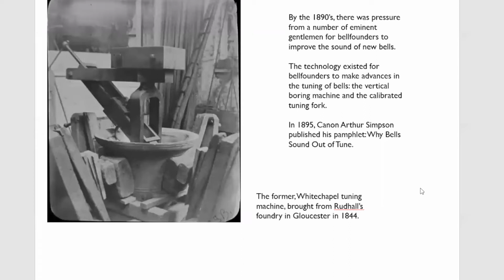They'd almost got their octave hum, and in their large bells, the fundamentals were only tending to be a bit flat. So they didn't have to make a radical difference in their shape in order to produce harmonically tuned bells. In 1896, with the new tuning machines installed, they sent out Newerby, where they'd augmented a 4 to 10. And of the 6 new bells, only 2 of them you could say are true harmonic. The other 4 aren't that far off. So they'd made quite rapid progress.